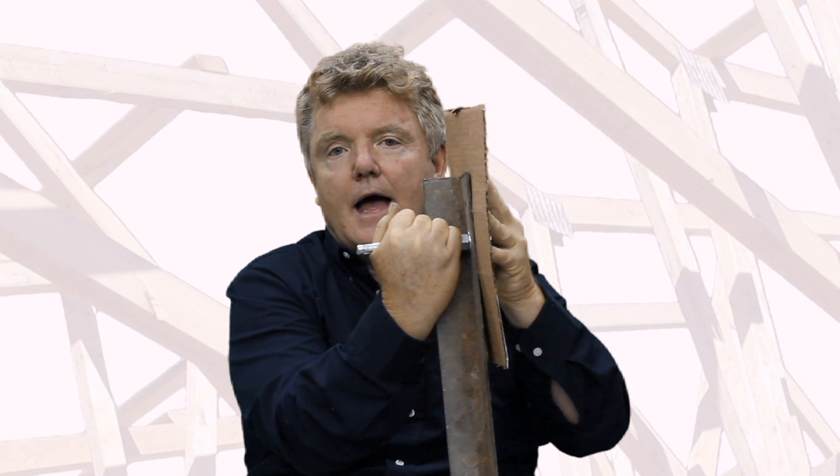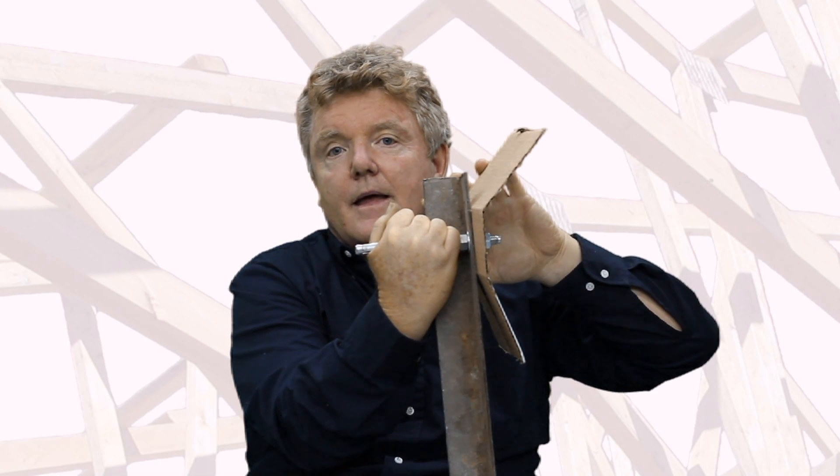Another problem with angle irons is that they put wood under a condition known as cross-grain bending, which is not allowed by the building code for most retrofit designs unless it's absolutely necessary. Here I'm going to give an example of what cross-grain bending is and why it should be avoided. Here I have a prop — there's my sample angle iron, and here's my floor joist. When the floor joist pushes against the angle iron like this, you can see that it will be restrained fairly effectively. However, when the earthquake pushes the floor joist the other way, it bends — and when it bends, it can cause the floor joists to split, causing very serious damage to the floor, and it will fail.